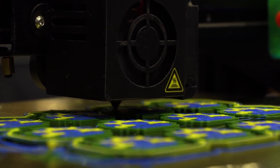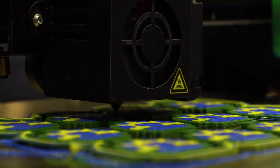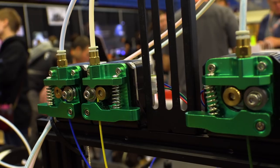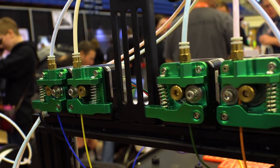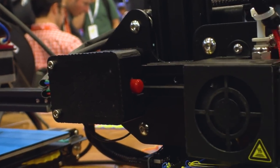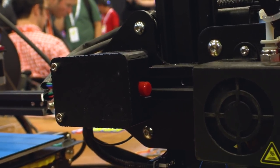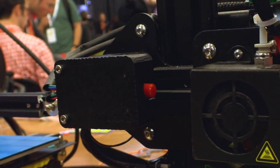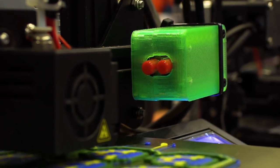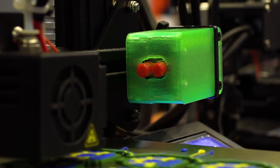Any printer at all? Any printer, yeah. The idea here is that we no longer need modified firmware or hardware to support this. This literally will mount to pretty much any printer. So this is just G-code powering this? It's G-code, yeah. What we have here is a switch that is literally switching the motors between left and right — it's an actual hardware switch. We took it a step further on the 4-color, where you can see here we have two switches.